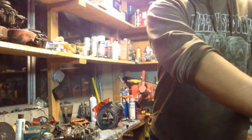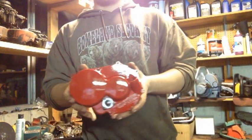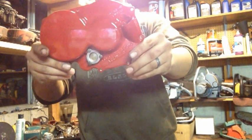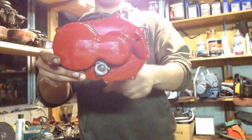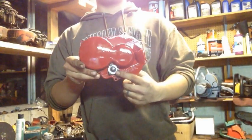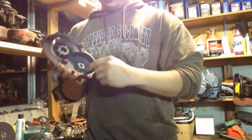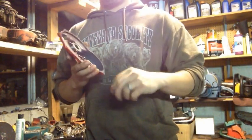I don't know if I showed you guys that I had gotten the side cover painted up and back together. Got the sight glass cleaned up, so now you can actually pretty much see through it. There you go — you can see my hand moving through it — and then polished up the retainer on there. Then I got the bearings cleaned out, little needle bearings, flushed them out real good.